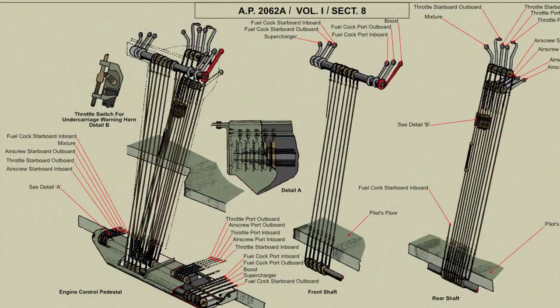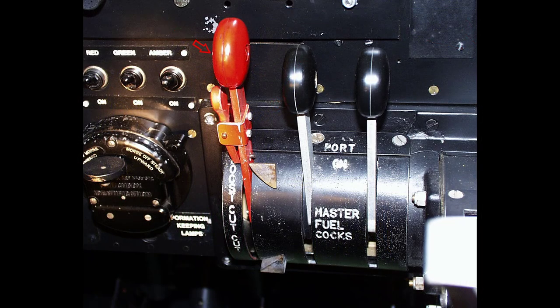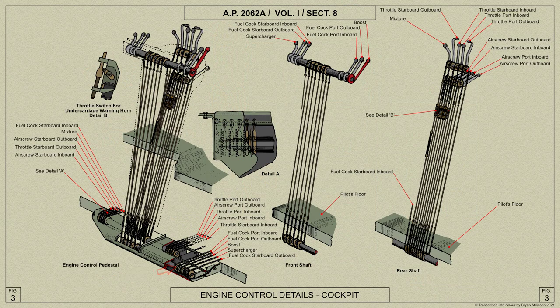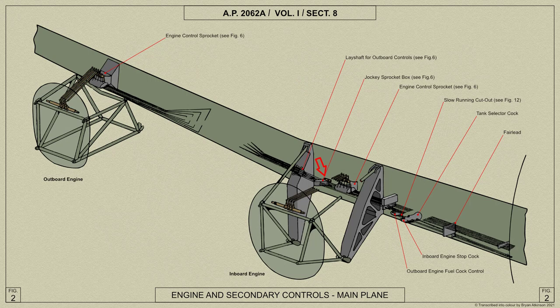The mixture lever, if in the weak position, automatically returns to the normal position when the throttle is closed for slow running. The boost cutout control is cable operated from the port rear countershaft in the main floor, through a spring-loaded crank lever on the jockey sprocket box on the front spar in the inboard nacelle. From the crank lever, one cable is led directly to the inboard engine, while the other follows the other controls